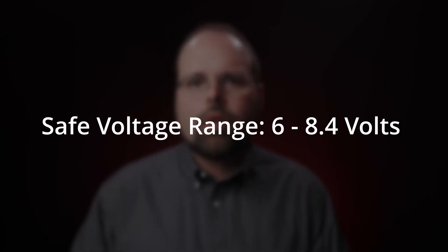These voltages come from both the voltage range of the LP-E6 battery and Canon's own CA-946 AC adapter's output voltage. However, it's also potentially possible that the camera could tolerate as much as 9.45 volts. This is the maximum allowed by the USB power delivery standard when operating in 9-volt mode, so I know the camera should be able to tolerate that on the USB-C port. What I don't know is if that translates to tolerating it through the battery bay — and I'm too chicken to test that theory with my camera.